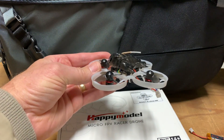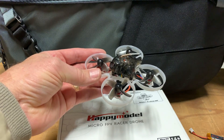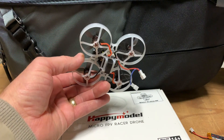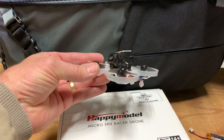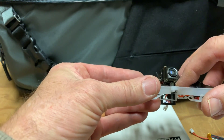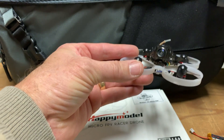The first con is it's not really an innovative product like the Emax Tiny Hawk. I know they're different classes — this is a 2S and the Tiny Hawk is a 1S — but the Tiny Hawk is a significantly more revolutionary type design than this. They kind of just used an existing frame that you can get. Another thing I don't particularly like is the frame design is not well thought out. They have these short grommets where the whole flight controller board just floats up and down. I'll link a video on how to fix that. I don't necessarily like the frame design.